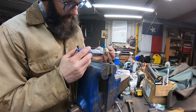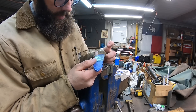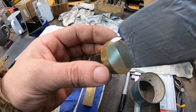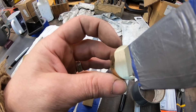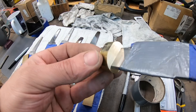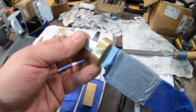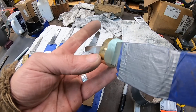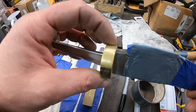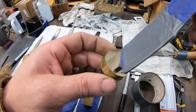I took out the last little bit of room and was able to set this right down on the shoulders. You can see that gap is almost completely gone — we can get a little more out of there, but whatever's left is going to be very minimal. Keep in mind how soft your material is. Sometimes brass may not be as soft as it should be for something like this, and as you hammer on it, it's going to get more brittle. There is a point where you can't continue to do that. This stock is pretty soft and it worked out great — we've got a pretty decent fit-up on this.